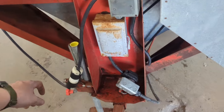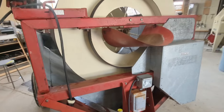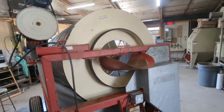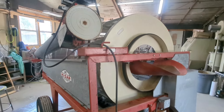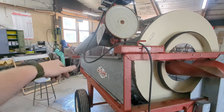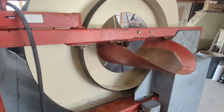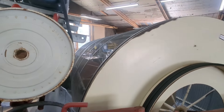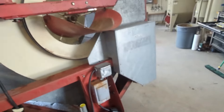I'm going to unplug the auger. Now with the auger unplugged I can just fire up the screen portion. I wanted to show you this so you can see how quiet and smooth it all runs. Again, the auger makes a lot of noise because product is not going up and through it — the auger flighting is smacking the inside of the tube because there's no product in the tube. It just hums right along, everything works as it should. We put a new drive belt on the in-feed auger and a new drive belt on the motor that runs the screen.